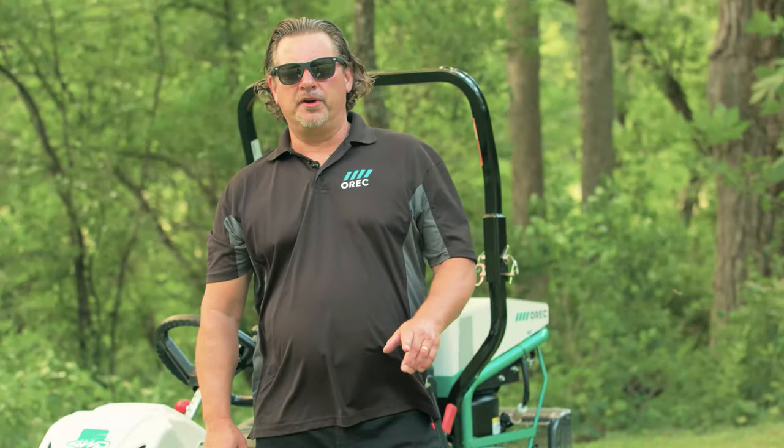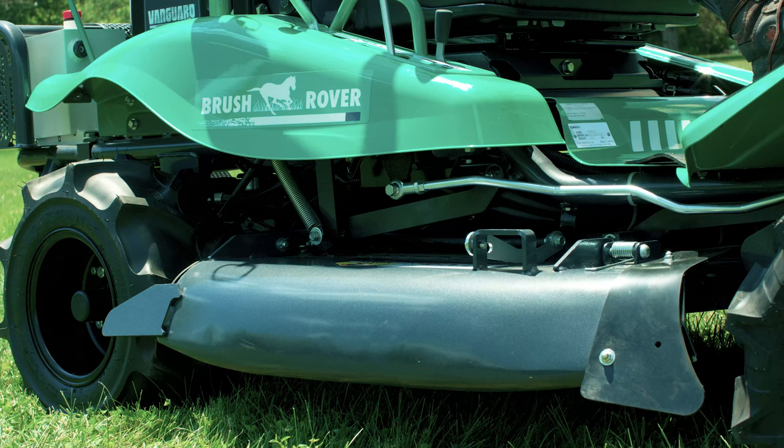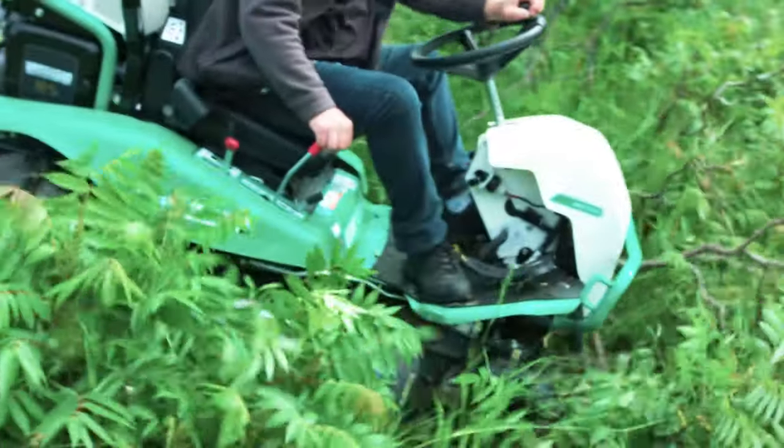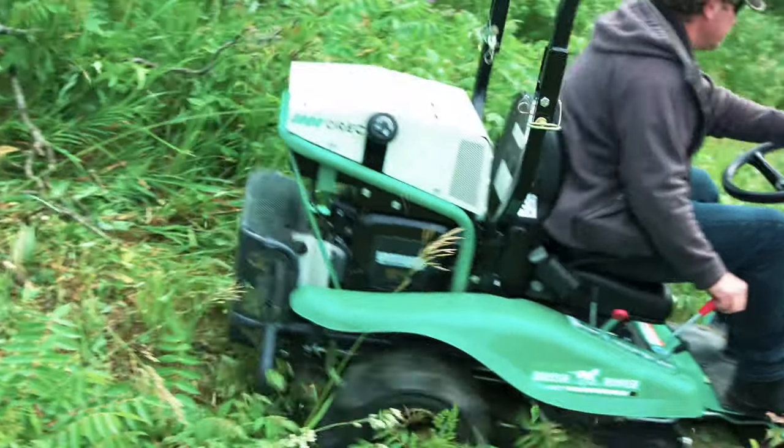The mowing deck itself is fabricated from a special alloy called Corten steel that is not only stronger, but more corrosion resistant than regular steel. This 13-gauge steel does not require repainting, and through a chemical process that occurs as it oxidizes, it forms a protective coating due to its unique chemistry. Another key feature of the mowing deck is that it is spring-loaded, allowing the entire deck some give so it can float above any large obstructions it might encounter.